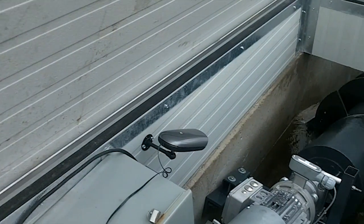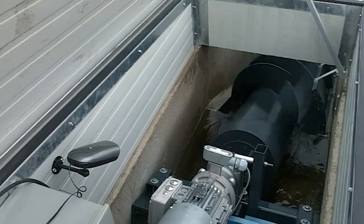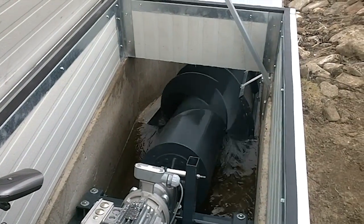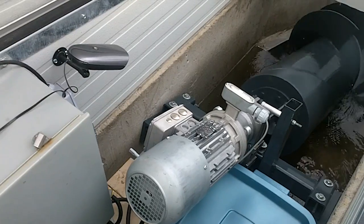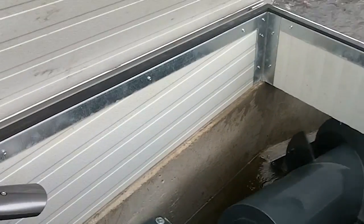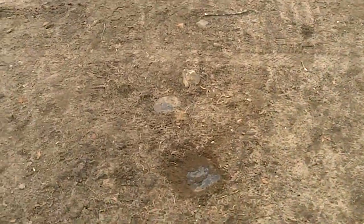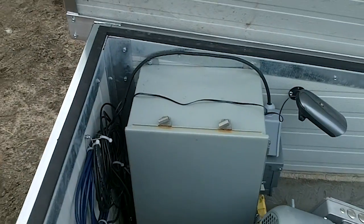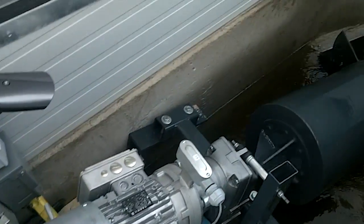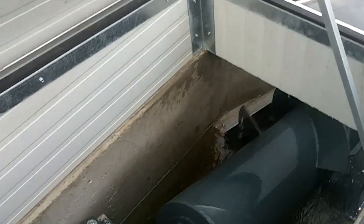You can see the camera so we can monitor it at night for winter freezing — we're doing some of those tests. Right now the screw's running at full capacity, about 72 litres a second. We've got a slight wobble in the motor there from testing. Most of this is just some control data loggers. We've got a couple of access holes back here on the ground — you can see the black caps there that have our flow sensors within the channel underground. There's our control box in the corner there. We've got an internet connection coming out here so we can have the camera and some data loggers feeding our computer.